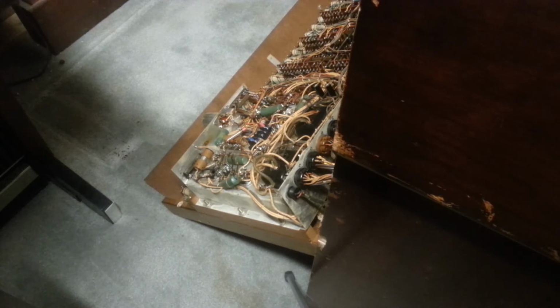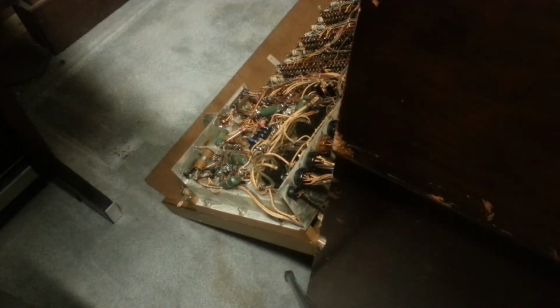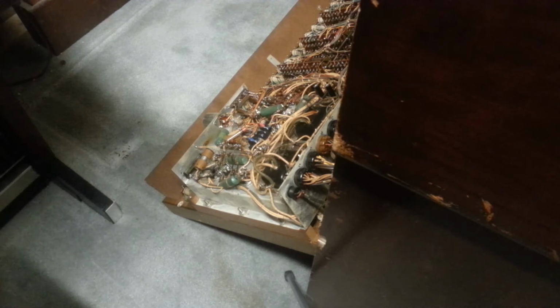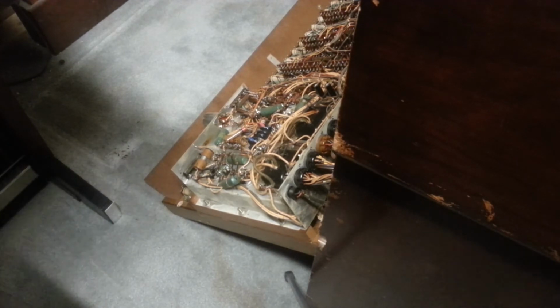I had to put together a whole bunch of series and parallel, I think they're half-watt resistors. Maybe they're 1 watt. And I knew I didn't have enough of them because I couldn't make it fit neatly in that space if I put enough of them. So the resistor was barely adequate, and did burn out 3 times, and I had to keep replacing those resistors, and that's why that ugly terminal strip is in there, to make it easy to do that. And that resistor has burned out again, and also at least one electrolytic condenser has gone south. So now that I have that schematic and know what resistors I need, I did order some right size resistors.